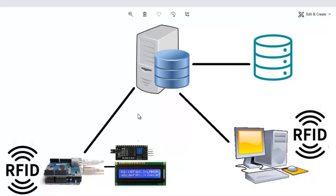The project consists of an access control system for a restaurant. If a card holder has one or more meals on his card he can enter; if not, he has to recharge his card using the administration panel. When a card is scanned, a request is sent to the server with that card's ID. The PHP code queries the database and returns one of two responses: either the card does not exist, or the number of meals left for that card. According to that response, the display on the LCD will change.